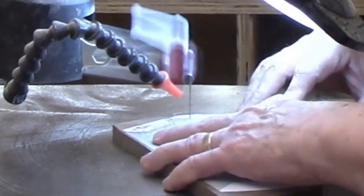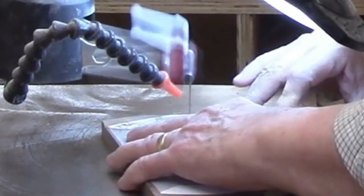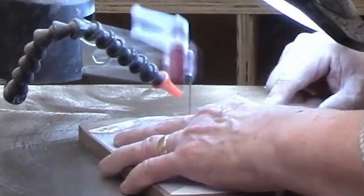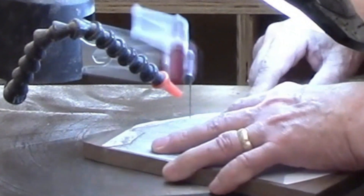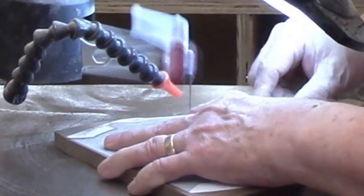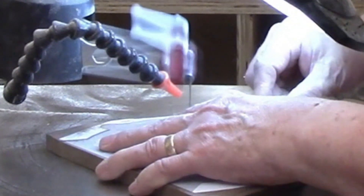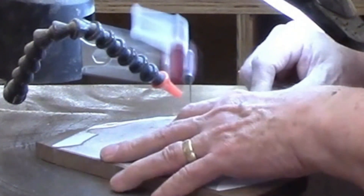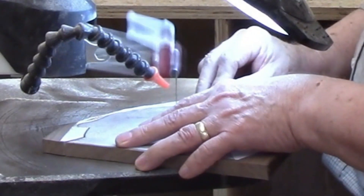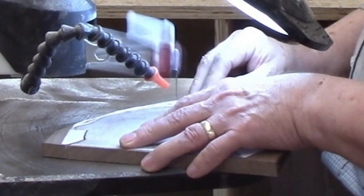The backer can easily be cut by a beginner. Use your hands to guide the workpiece, let the blade do the work, and don't put too much pressure on it. Scroll saw blades are very small and can easily start to flex if too much pressure is applied. If the blade flexes, you lose accuracy, especially on curves. At worst, you can end up with a piece with sloping sides — larger at the bottom than at the top — rather than a perfectly straight 90 degrees.